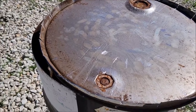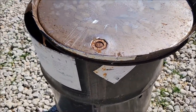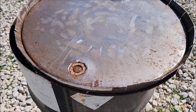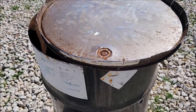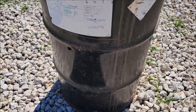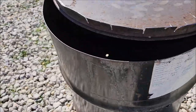There are going to be a lot of sharp edges. I'm usually always wearing gloves when burning with these barrels because of the sharp edges and everything else being thrown in. If you want it nice and smooth, hit it with a grinder. I don't paint them — as soon as you throw fire in there, even the enamel paint that's on it now will be gone in about five minutes. So I just go get another barrel if I need to.